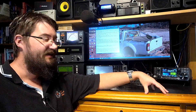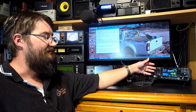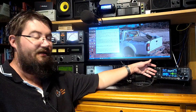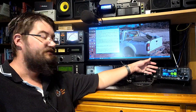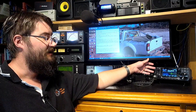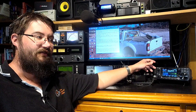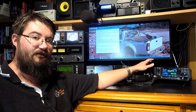Is it overkill for repeater work? Well, if that's all you're planning to do with it you could probably get away with a mobile radio, but I quite like having a full-size radio on my desk. I like the scanning speed, the fact I can scan two bands at once, and the audio scope. Unlike HF where I rarely use the audio scope due to band noise, it really comes into its own on FM. One note: you can't have your main and sub receivers on the same band — no two-meter plus two-meter combinations.